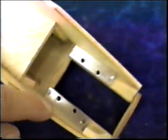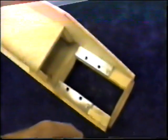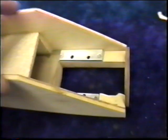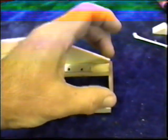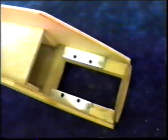Now, we had choices, like on the Spitfire, what we did is we rounded the mounts and the doublers. Well, on this one, we wanted to leave that meat up front. I wanted to leave this, because it was a wider fuselage, and I'm going to have a little bit different taper in the front. Remember, this is a different fuselage, but obviously, if you're making a Cardinal or something, you might want to bring that in. So to make up for that, I want to make a little block in here. Remember, this nose section is going to be relatively flat and then dive into a spinner and have big valve covers here. So I wanted to have those plywood doublers. I didn't want to have them curve in. That was the whole method to my madness here.